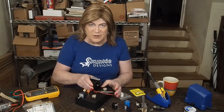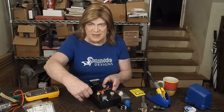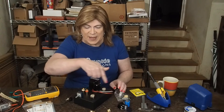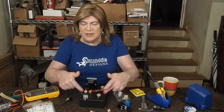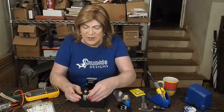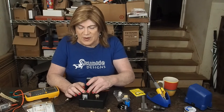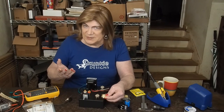I'm going to have the power transformer here in this back corner, and we're going to put the power switch on this side back here to keep all the AC in the back. I'm going to put the rectifier tube right here next to it. I'm going to mount the choke somewhere — probably on the side or maybe in the back — but we're going to have all the power supply stuff in the back. That way, if we do have some hum that we want to shield off, I've got some MU metal and I can build a little bulkhead to shield the AC from the signal path — hopefully we won't need to. Plan on putting the volume control here on this side, the tube up here in this corner in the front, the output jacks on the top right behind the volume control, and the input jacks over here on the side.